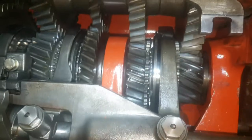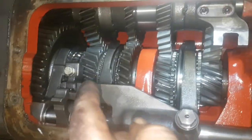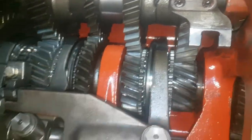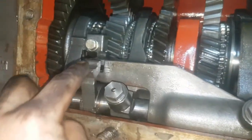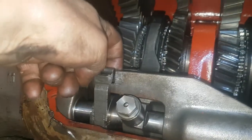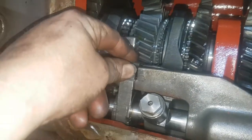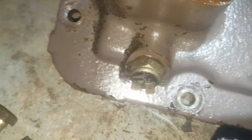Just have to put this cover back on. That's the other reason why I take off this cover — another guy pointed it out: you will not get that selector fork over the selector bars, not a hope. And I see what this is as well — it prevents you from moving it right or left when it's in gear, so you've got to take it out of gear to select your high and low. That's what this gizmo is for. The other part is actually in the tractor itself — there's a little valve in there, and that's your high low sensing.